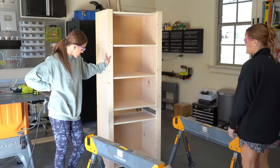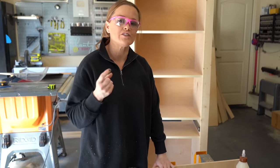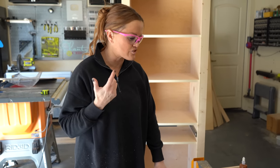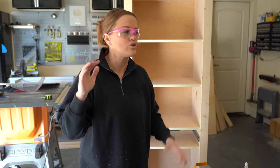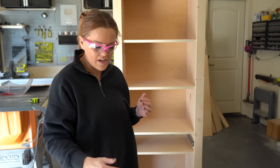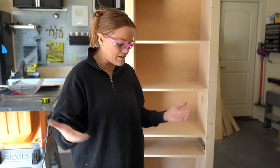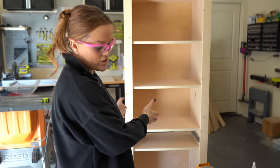Definitely a beginner build, I think. Definitely. So we're gonna build the drawer now. This entire thing is gonna be built with 1/2-inch plywood. So I actually just purchased a 2x4 panel at the hardware store. And I've ripped down my sides. The sides are gonna be 4.5 inches deep on the table saw, and then the base of it is gonna be on the measurements on the plan.